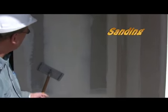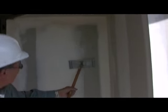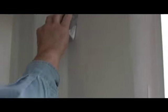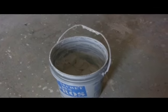Step 8: sanding. Now, finally, sand very lightly as needed with a sheet of fine 150 or 220 grit sandpaper. Do not use coarser grit paper except for problem areas like the meeting of two inside corners or narrow strips where you can't properly use a knife to prepare the surface. Use a sponge sanding block for the tough corners. Dust or vacuum the surface, shine a light again, and fill in any remaining imperfections with thinned mud firmly drawn down. You shouldn't have to sand again. Avoid sanding the paper surface of the drywall.